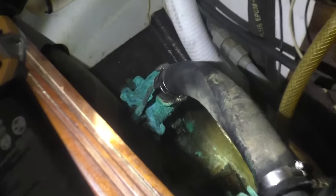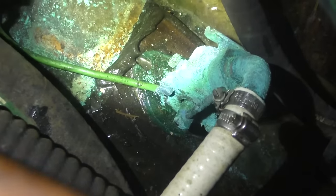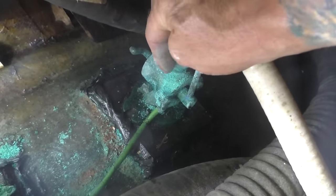That's for the drains for the sink and the bathroom here. Over a little bit more — that little one — that's the water feed for the toilet. Now the trick here is it's got a little T-handle on the back side. You got to loosen that first, let it leak a little bit, and then you can turn this handle here.